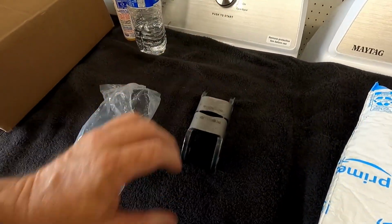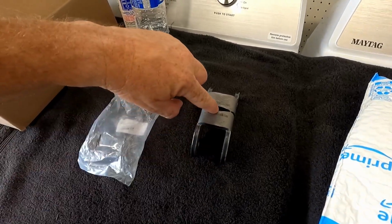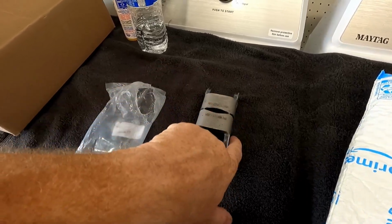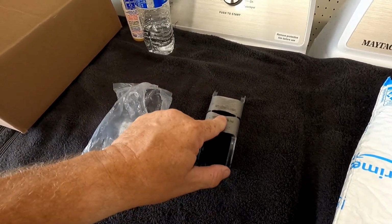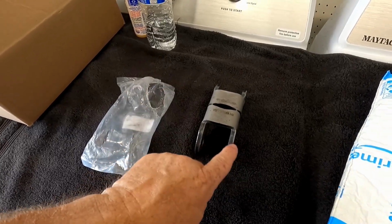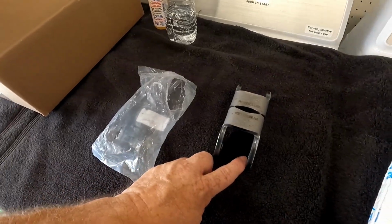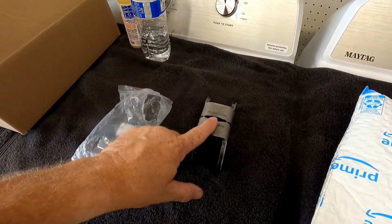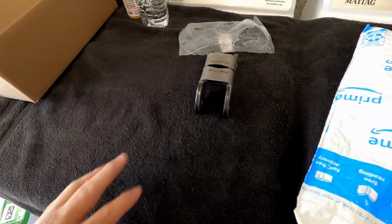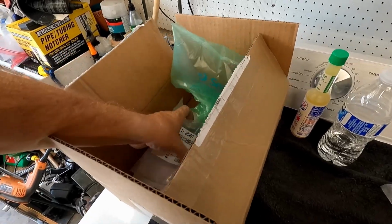I mean, these are nice. They don't quite fit here. There's a little bit of a gap here, so I may cut it down the middle, bolt them in where I want them, and then re-weld the middle once I have the sides welded, so I know exactly the thickness. It might be 3/16 too wide, maybe a little bit less, but I could use a spacer. We'll check that out when we get there and make that decision. But also what I needed was longer bolts.